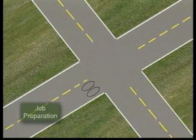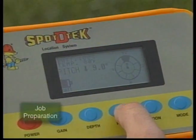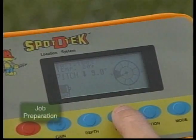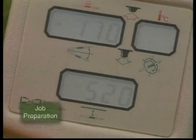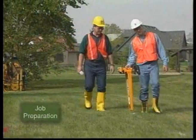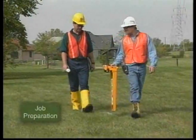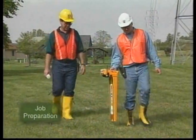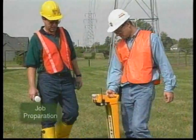You must be aware of the surroundings, the normal functioning of the tracking instrument, and deviations from normal information. For example, a roll position that jumps when the drill head is still, or pitch information that is not consistent with depth readings could indicate a problem. You must not rely solely on electronic display readings or boring information. Rather, rely on common sense and factor in drill pipe length, pitch, ground conditions, and thrust pressure to assure that interference is not affecting depth readings.